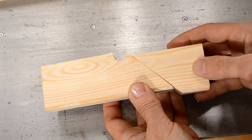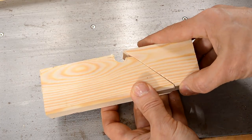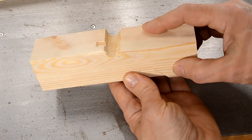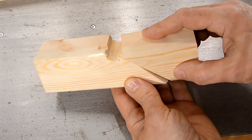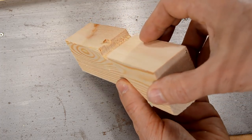With an inclined plane, you essentially raise and lower the infeed table like this, but you have to make sure this rests on here exactly flat, or the tables won't be in line. You also have to make sure it doesn't twist, because that will cause the tables to be skewed with respect to each other.